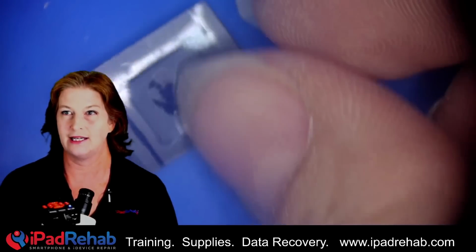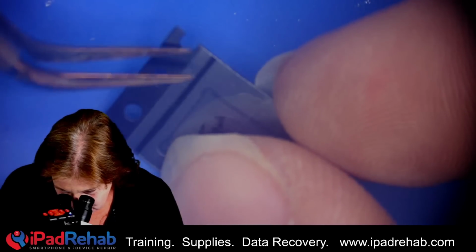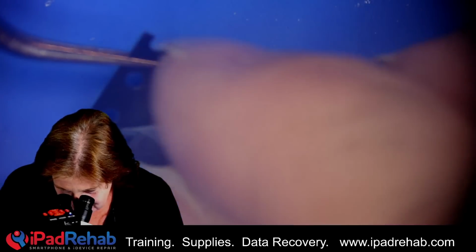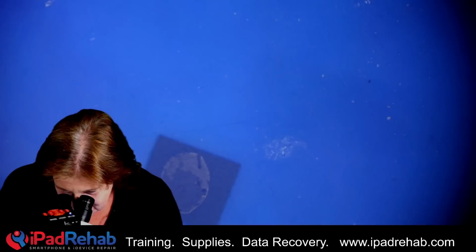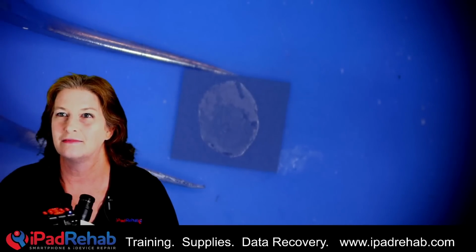And the magic of the internet, it's a few days later and I have a brand new PMU for our iPhone 13 Pro Max. So let's go ahead and open it up, take a look at it. And the first thing I'm going to do is actually re-ball it. Yep, there's the chip with the marker on the Apple logo straight from China. Look at that. Can you see that? There's a marker so that it can pass customs.